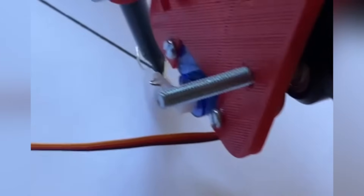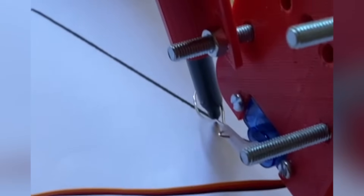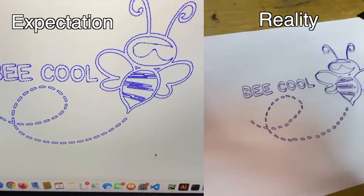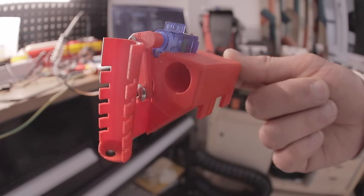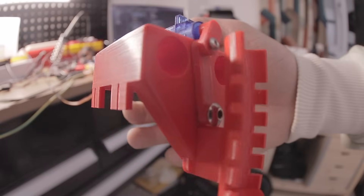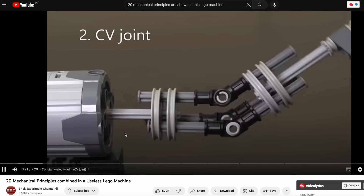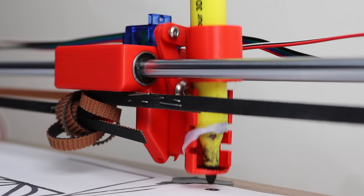The second big issue was the pen mechanism. It's kind of hard to see, but the pen was just sitting on a folded paper clip. Talk about DIY prototyping. Besides there being way too much wiggle room, which already makes the drawing less precise, it was only being pushed down by gravity, which didn't let me control the pressure of the pen. Fast forward to today, I got this awesome linear actuator mechanism, which was totally inspired by a Lego build video — the link is in the description. This, along with some rubber bands, allows me to precisely control the position of the pen and also somewhat control its pressure.